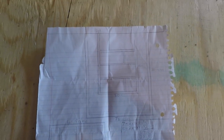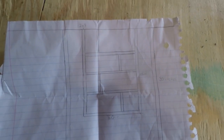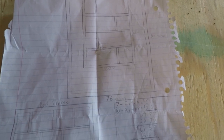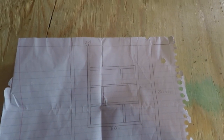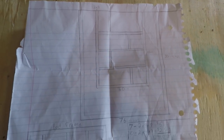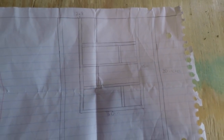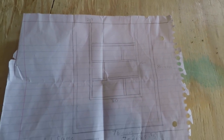First off, you're going to want to go ahead and design your own little platform. You can do it in many ways but the simplest way is right here. Depending on the size of your bed and what you're going for — I'm doing 65x60 inches. That'll be like the middle part. That's how you decide what height you want. I went with a 2x8; you can also do a 2x10 but it might be a little bit higher. This is my design for the actual platform of the bed — I'm going to have bed slats going in between and the headboard in the background. That's what we're building to start off with: the 65x60 inch base.